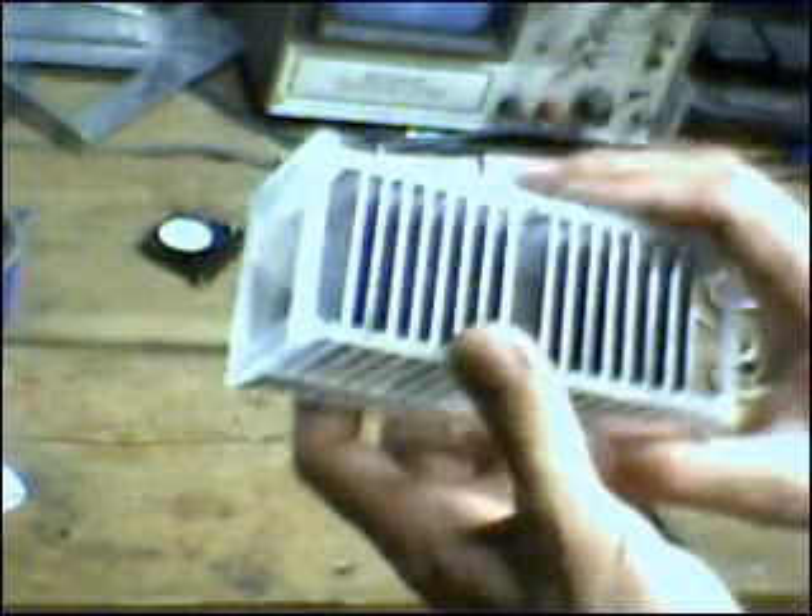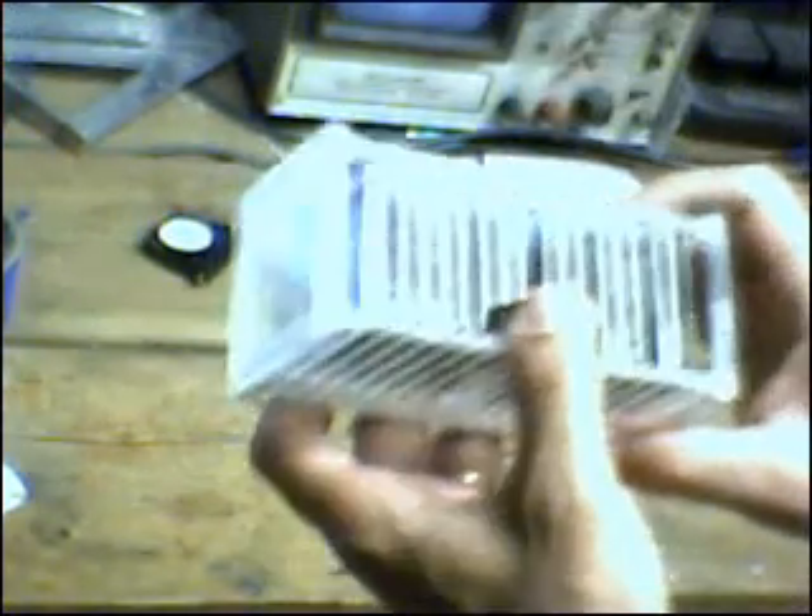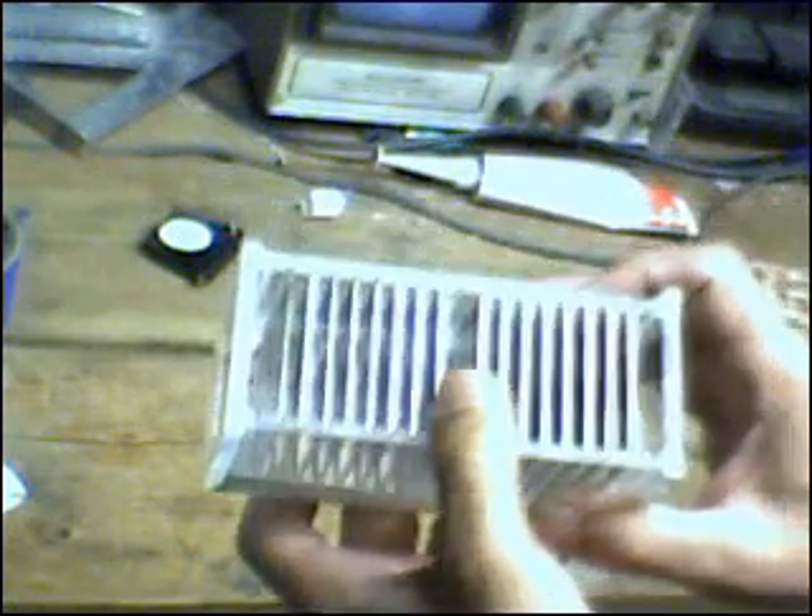So we are going to find out. I should be able to come fairly close to an open bottom rather than having a frame which is only a half an inch all the way around. I will be having the one-eighth inch holes drilled between the plates, and that should allow enough flow. I can then experiment by blocking some or all of the holes and see what effect that has on the results. The whole point of this test fixture is to create a platform on which to experiment, and we want everybody to experiment on their own and see what's best for them.